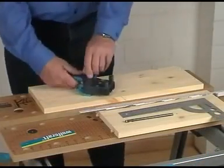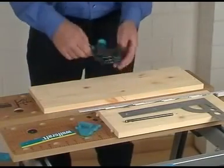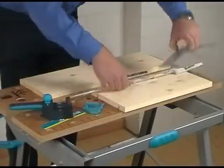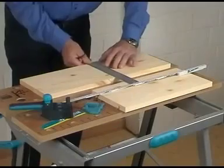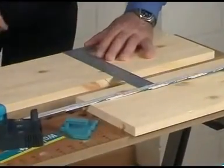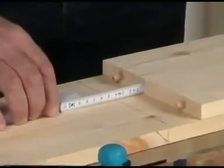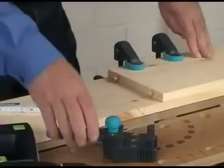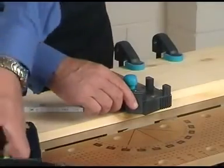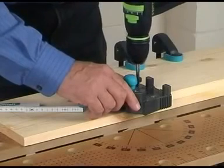Only at the making of T-butt connections the Dowel Master is used without stop. For all other works it can rest assembled on the Dowel Master. Afterwards, please draw with an angle the middle of the intermediate bottom on the side walls. Please clamp the bottom 40 mm from this marking on the sidewall. Afterwards, you once again put the Dowel Master with the 8 mm guide groove over the dowel until it lies against the bottom edge. Please drill afterwards the 2 holes with the cordless screwdriver.